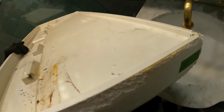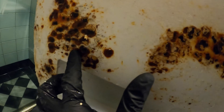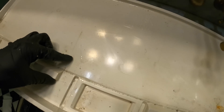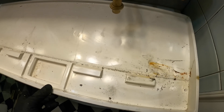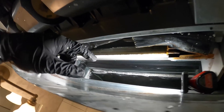They could use a new pan here — it is kind of bad. This thing is pretty chewed up. I wonder if anything is going through these holes. I would want to dry this up, fill it with some water, and possibly test that pump. I think water is getting in — it's going through the pan. There's a slit here, this thing is done. We want to make sure the pump is actually working. Inside here is our condensate pump. Water fills up, there's a float right there. This thing pumps out through here, shoots out this way and down the drain.